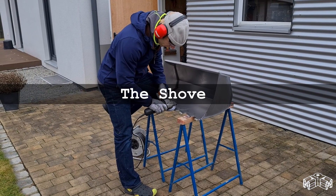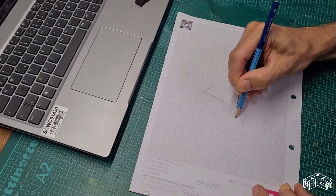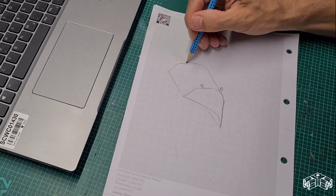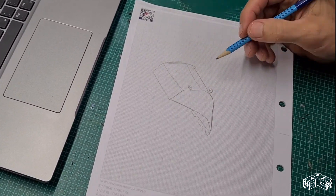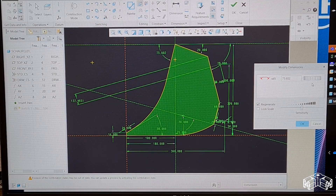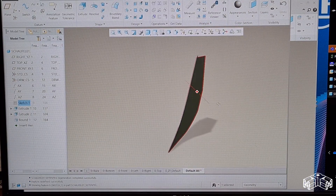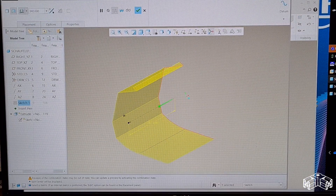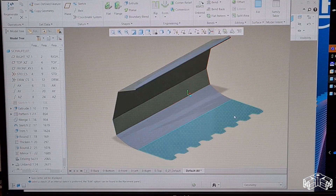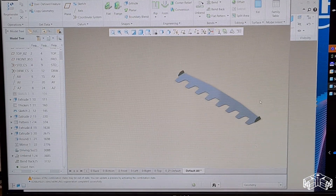The shovel. There are no suitable shovels available on the potentially endless internet — nothing from Reddigger nor from some rare Caterpillar store. I had to build something by myself from scratch. 3D printing the shovel from plastic was no option, because this part was way too big and would come out too fragile. I also didn't dare to go for plywood for reasons of stability and wall thickness. So I headed for a welded sheet steel solution.